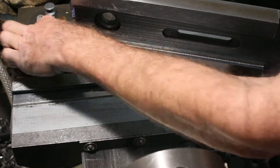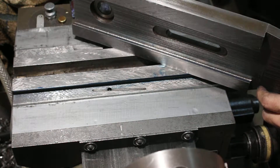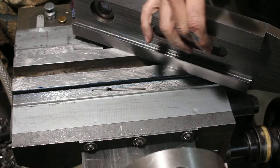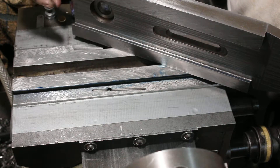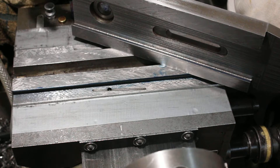It's also parallel to this, so I measured that in a different video. And now I'm checking this angle to that angle. This will be the last one here — this is the driven side, if you want, and it's got the gib that's added from the back here.